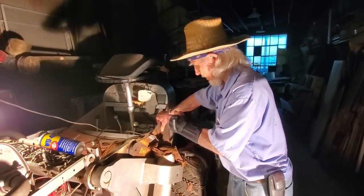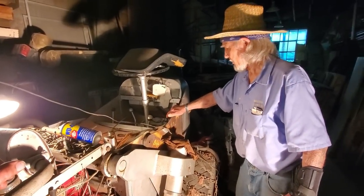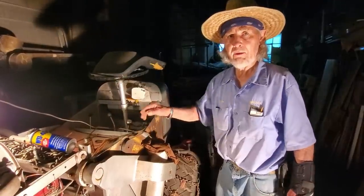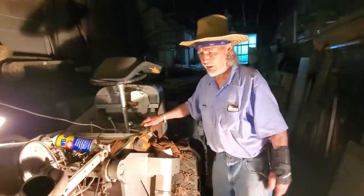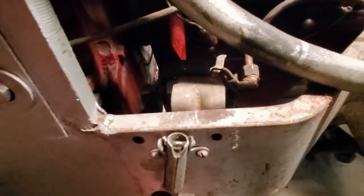We can disconnect the line at the carburetor and possibly run all that right on out that way too. Yeah, that might work. The carburetor line is easier to get to than underneath the tank. Carburetor comes in down underneath your interior exhaust. We're down here. Carburetor. So yeah, the gas line, Grandpa's right. Whoa. There's a gas line down here. This is the gas line, and it goes through this fuel filter. And there's a petcock on the bottom of that. Well, maybe we could drain it right there then. Perfect. We'll try that first and then we'll see.